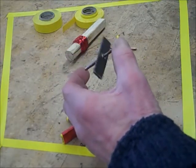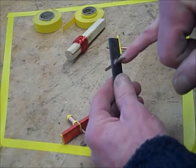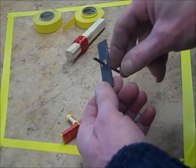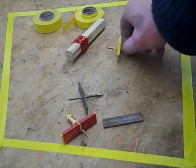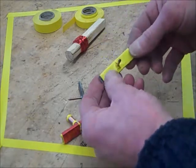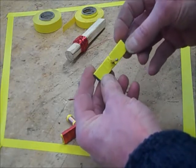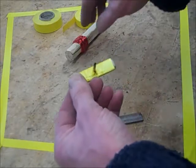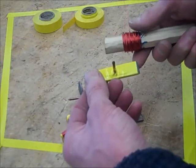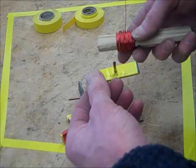For the soldering portion, I run the little center area across a grinder to clean it up. To keep the core from being short-circuited across the wire, I wrap the armature's core in two layers of electrical tape — I'm using yellow here so I can see what I'm doing through the windings. I've got about 18 to 20 feet of number 26 gauge magnet wire that will wind down in one continuous coil.